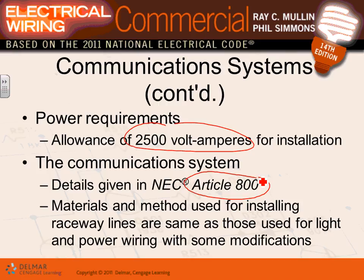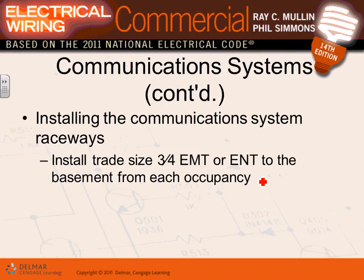Number one, what happens if you short through the cable TV coaxial cable? Now somebody goes to touch the TV and gets electrocuted, because the coaxial shield, if it's not grounded especially, can shock you. So we separate them completely for two reasons. Number one, safety, and number two, because we don't want to impose interference on telecommunication cables.